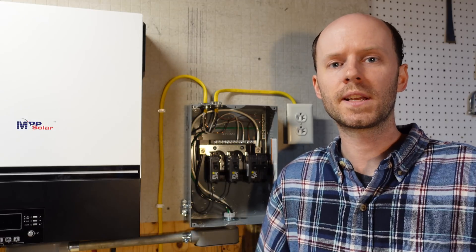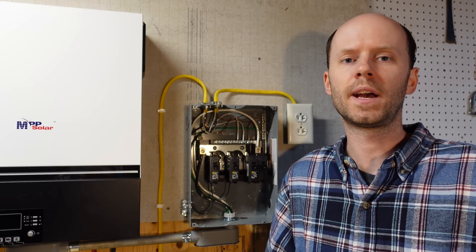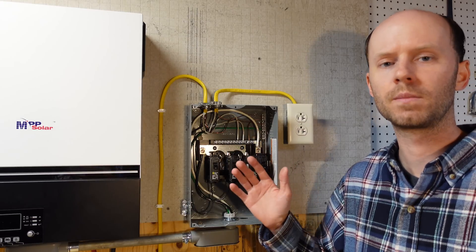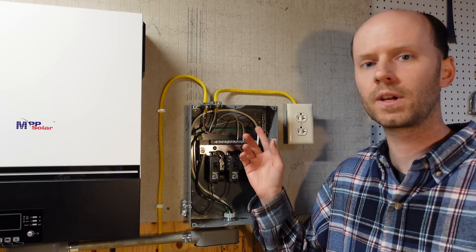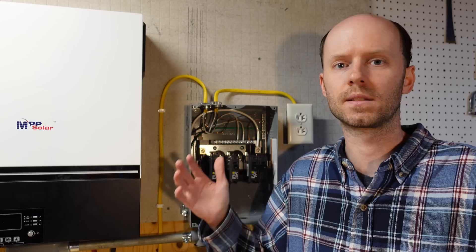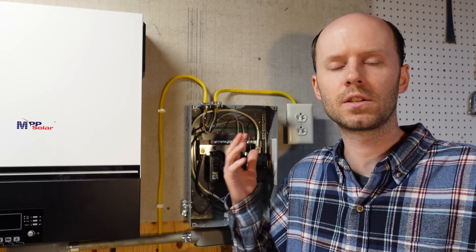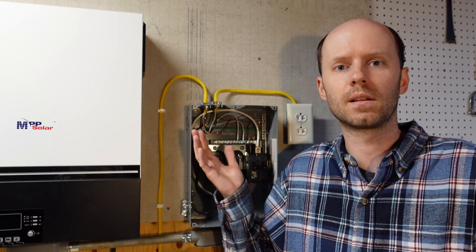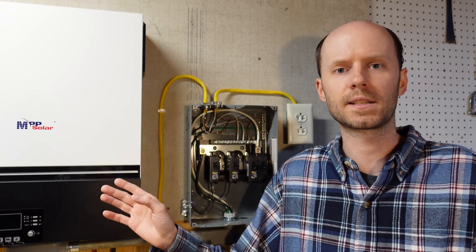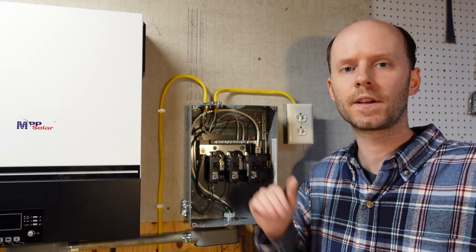I hope that makes sense. To be clear: if you are using the AC input to this inverter, everything I said does not apply — you already have the neutral-ground bond in your AC input source and cannot have a second one in a separate panel. In that case it's treated as a sub-panel and the neutral and ground should remain separate. And as always, anything related to electrical work should be done by a licensed electrician, so please don't take this video as professional advice. If you think I missed anything or got something wrong, please let me know — I'm very interested in learning. Knowing that the bond screw can be removed and the inverter can be wired this way does completely fix the problem I had with it.